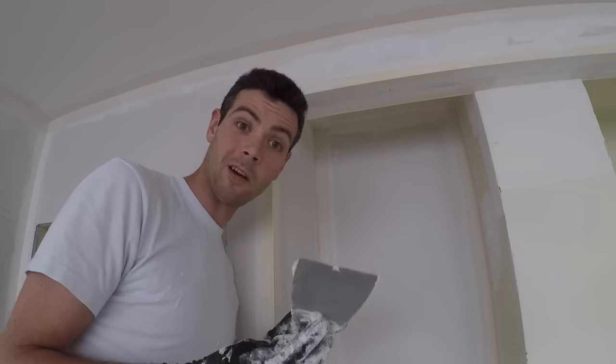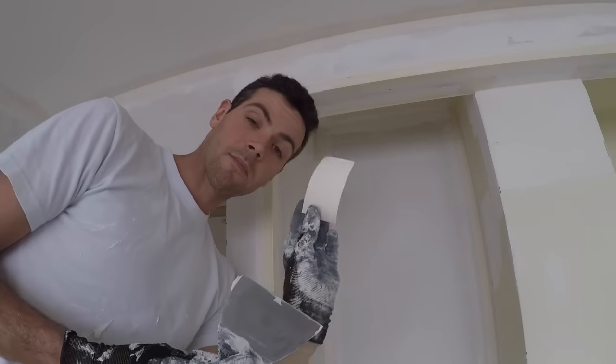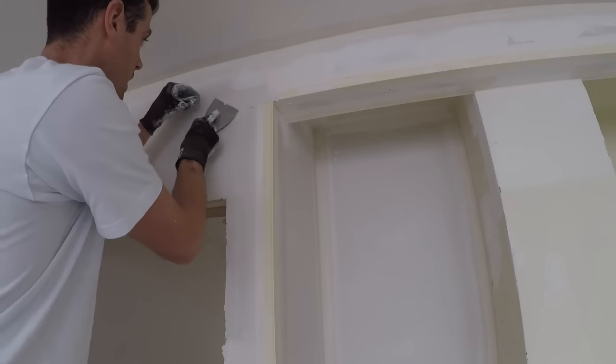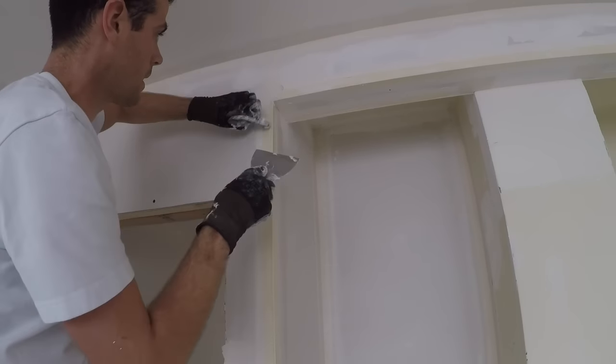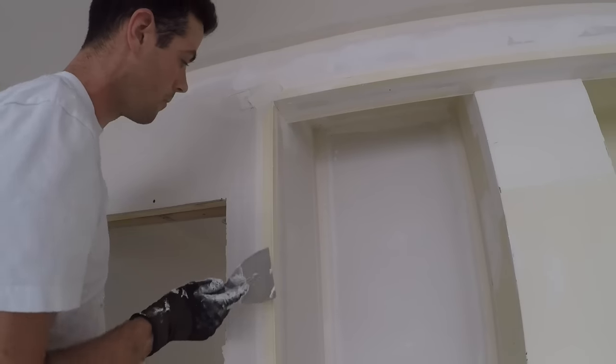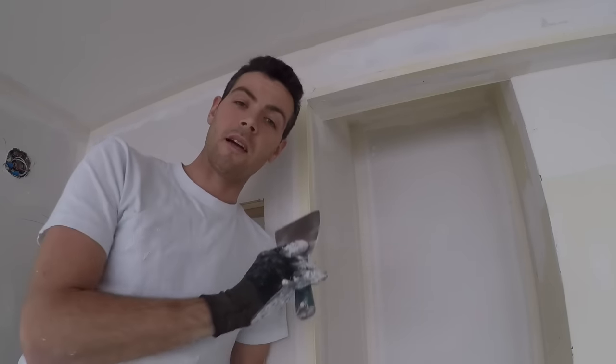Here's a really important tip: the area where the two corner beads meet is really prone to cracking. So what I do is take a piece of tape, put about an eighth inch of mud on it, and place it right at that junction. It goes about an eighth of an inch back from the nose of the bead. If you put it too close to the nose it'll hang over or you'll have a piece of tape you have to bury. But if you put it back from the nose of the flange just a little bit, the natural filling area from the corner beads covers the tape. It also doesn't hurt to let the mud saturate into that tape for a minute — it's going to have a way better chance of adhering and not blistering.